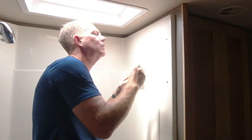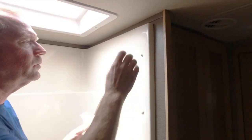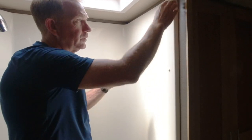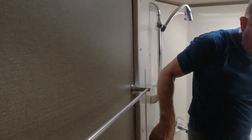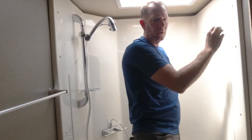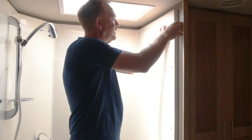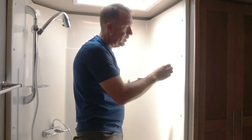We're reattaching the screws that we pulled out from the rail system to get some sturdiness back — putting the shower back against the studs on both sides. We have these little white end caps, and we're siliconing the screws as they go in so we have a good seal behind there, then we just pop these little caps on.